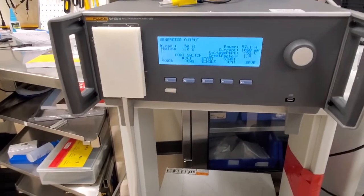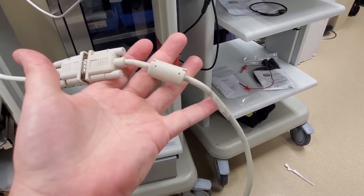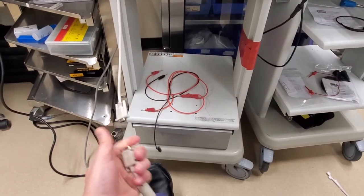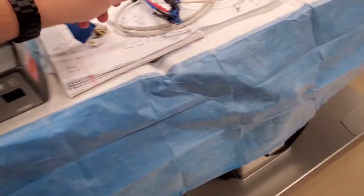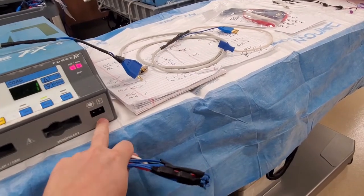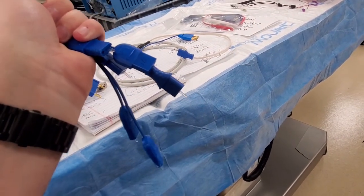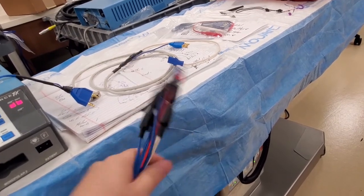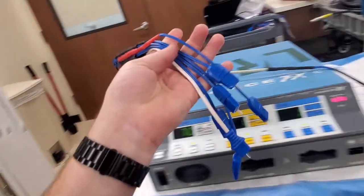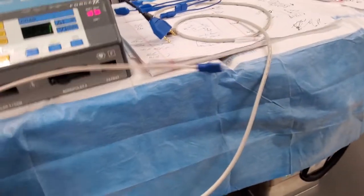Fluke needs to change some things, but this was my solution. It's a 9-pin pinout that gives me a lot of flexibility for creating various adapters for various tests, and no more switching around jumpers. Let's take a look at what it takes to go to monopolar — switch this out and disconnect it. These are my cal keys for doing REM cals. I've got 135, 137, 140, and 10-ohm options, with some dual pad and single pads to test various functions. I don't need to do the pinout for the CQM on here — for speed and accuracy, I know the ohms on these are accurate.